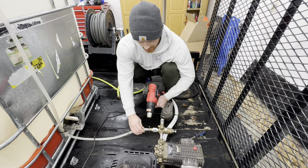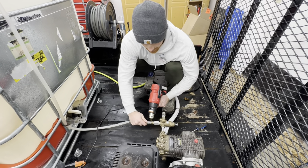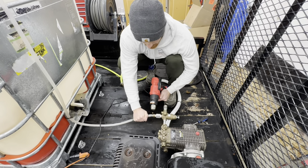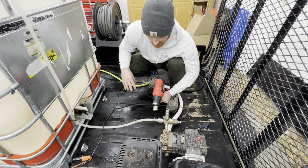The last part of winterizing the pump is draining the bypass line from our unloader. We've already loosened our clamp here and we're just heating it up to be able to pull it off. Once we get it off, that's just a simple drain of all the water left in this line, then reattach it for the winter.